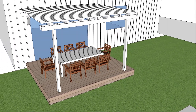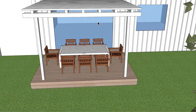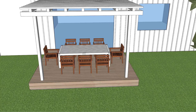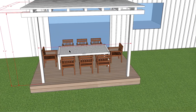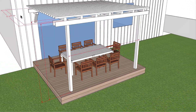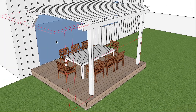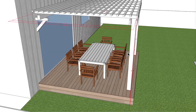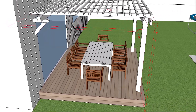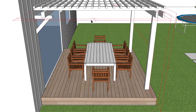Let's go ahead and take a look at this patio deck here with the pergola cover. Let's look at the dimensions first of all. Overall dimensions I have is 12 feet by 12 feet. You can see from post to post I have it at 12. I have it at 11 feet 10 inches to the inside and 12 feet 4 inches to the outside of the post.